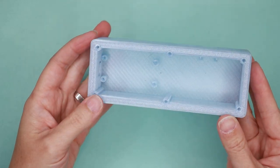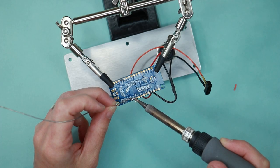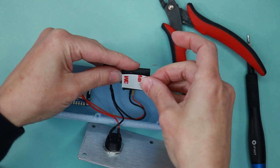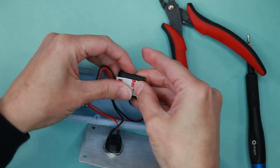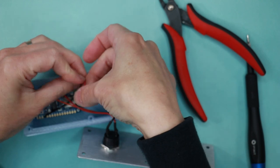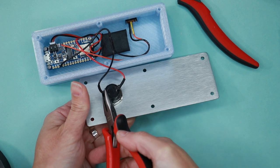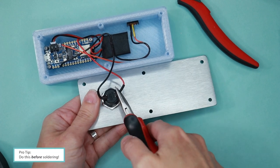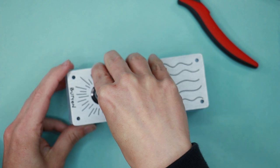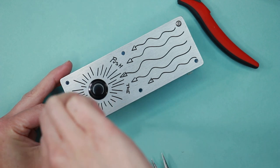Once the box design was ready, I printed it out in this translucent blue filament. I soldered the electronics together and placed everything into the box, adding a small LiPo battery that is held in place with a little double-sided foam tape. The feather board is located at the edge of the box so that you can easily plug in a USB cable to charge the battery or reprogram the board. After mounting the button into the faceplate, I bent the legs of the button out to the side so they wouldn't jam into the feather when everything was assembled. To attach the faceplate, I used M2.5 screws and they just self-thread into the mounting holes I made in the box.